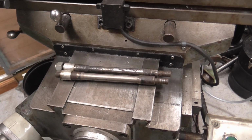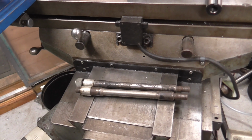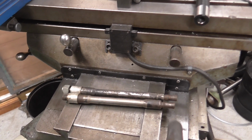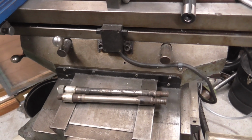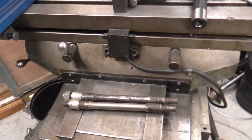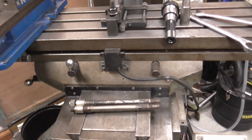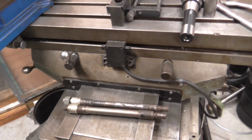But once a vehicle like a Lotus becomes an occasional use vehicle, and spends a lot of its time standing, the bushes wear and the doors drop, which isn't a problem on my Esprit. On this car, which had stood since 2006, as I recall, they seized up, and it's not uncommon to see the entire pin actually rotating in the mounting plates, which ultimately leads to the mounting plates getting elongated holes and all sorts of problems. So rather than make or buy new hinge pins and bushings, if I'm going to do any machining, it's going to upgrade to a maintenance-free system.